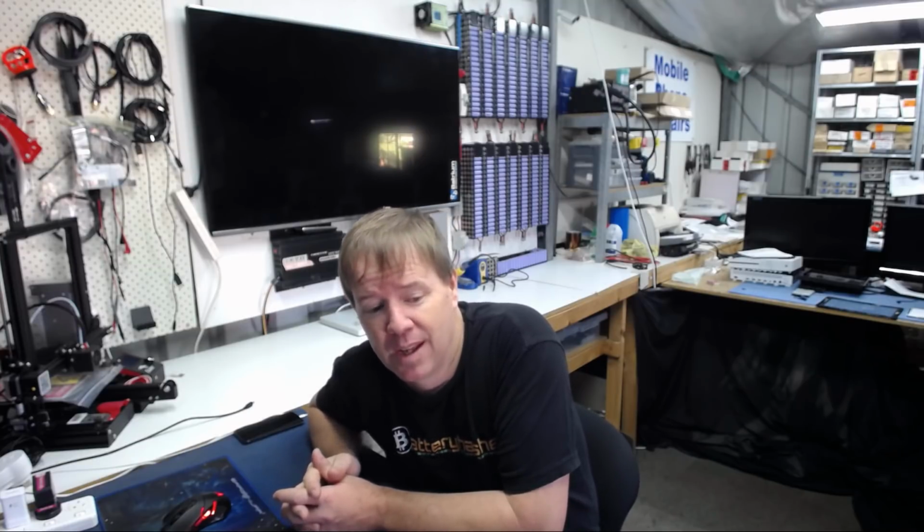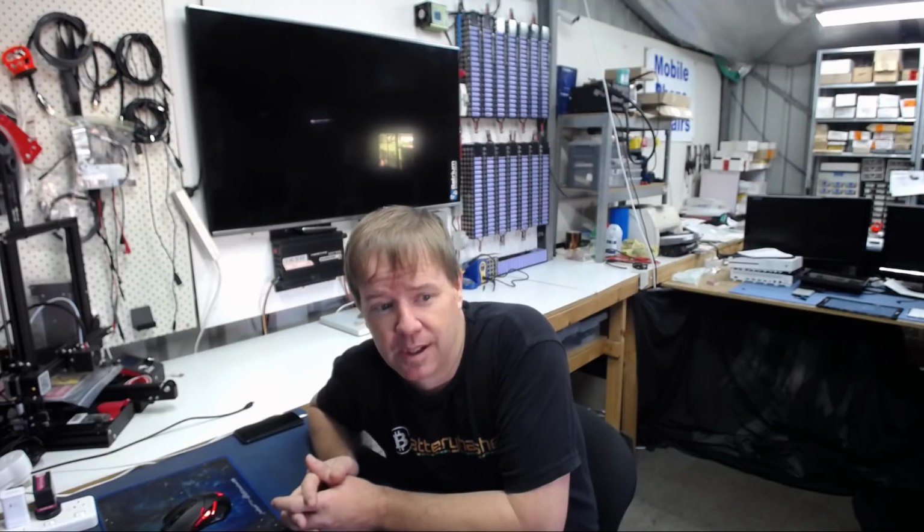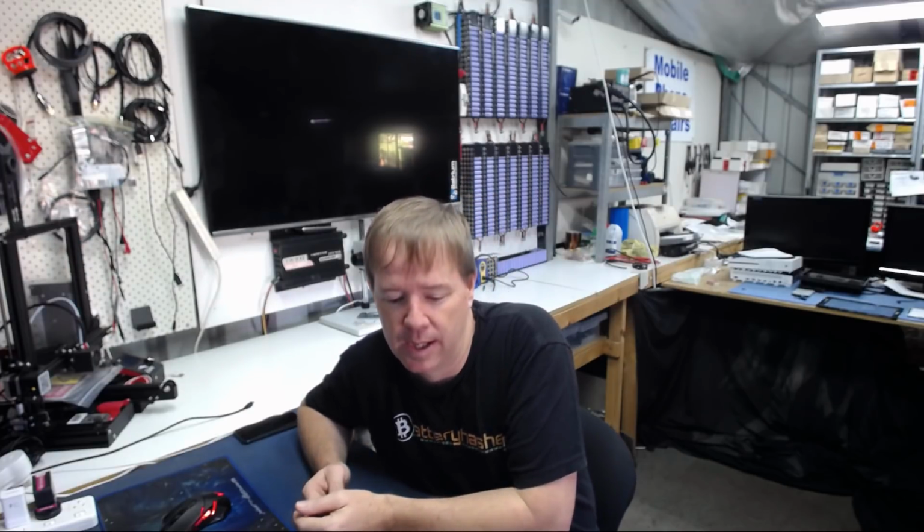I think the worst I've ever seen was about 50 degrees on the heatsink temperature. That was because when I first commissioned it, there's a thermal coating that needs to burn off, like you get that new electrical smell. That, and we were working it very hard for the video. It was running 2,900 or 3,900 watts or whatever, 700 watts through it in bypass mode, and then we closed the door and checked temperature and got the thermal camera out, and it was fine.